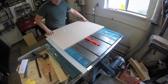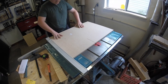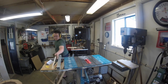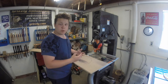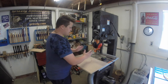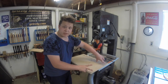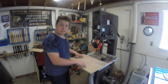The first cut is going to be piece A and it's going to measure 23 inches by 15. For the second layer of MDF that goes on top, this is where all the moving parts and important pieces are going to be. On top of the base we want to divide it into three pieces: a two inch wide strip, a 12 inch wide strip, and a nine inch wide strip — all 15 inches in length to match up with the 15 inch base.